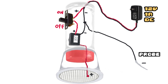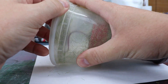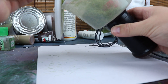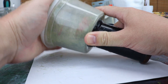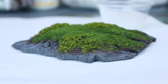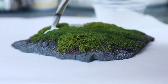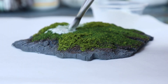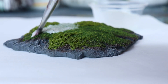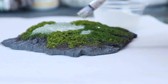With the device unplugged and the switch turned off, I'm going to pop the lid off and load up some static grass. For this demonstration I'm using some four mil static grass from Woodland Scenics. Put your lid back on tight and it's time to prepare our work piece. Here I've got a little blue insulation foam rock with some real short grass already glued to it. What I'm putting down here is a mixture of matte Mod Podge and water.